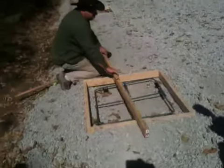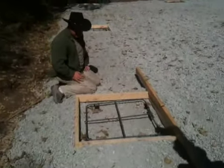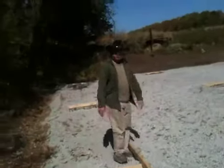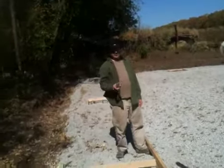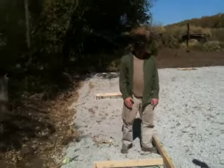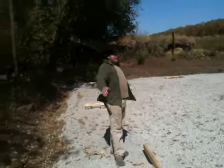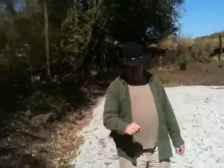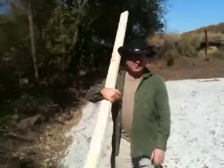We should have a little bit left over at the very end that'll slosh out. This is work that happens down on your knees a whole lot — it's often hard. The bigger the slab, the harder this is. When it gets big enough, like 16 or 18 feet wide, you want a power screed to move it because it really gets heavy. I've done one about that big and it was not happy.